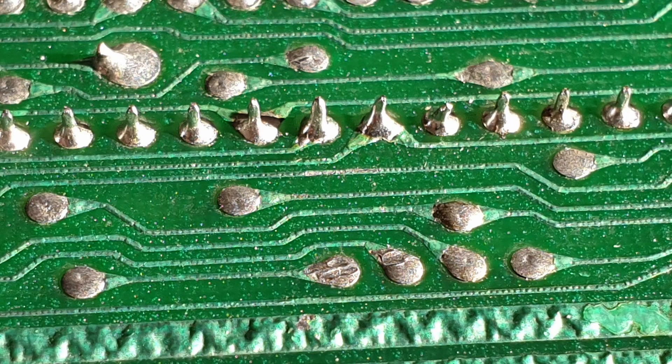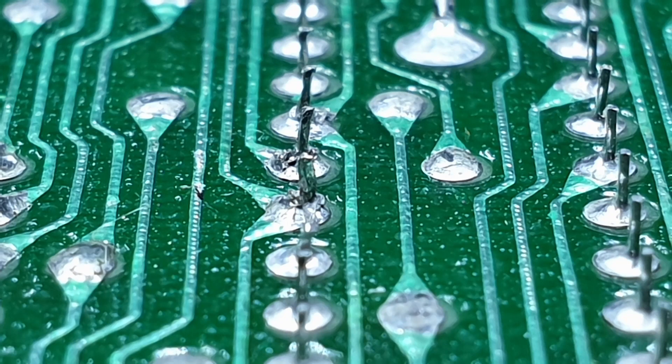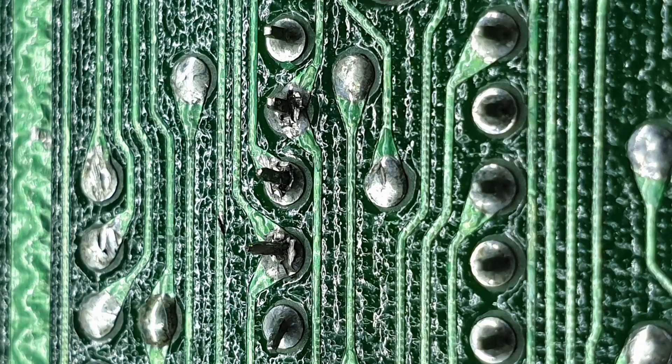I'm not actually sure why three pins on this had cold solder joints. You can see one of the pins next to it has been off to the side, so maybe something happened to the chip before it was put into the board and wave flowed, and that's just caused the solder to go bad over time. Looking at the rest of the board nothing seems to have been touched, so it does seem like it could have possibly happened during manufacture, but who knows the exact history of all these things.